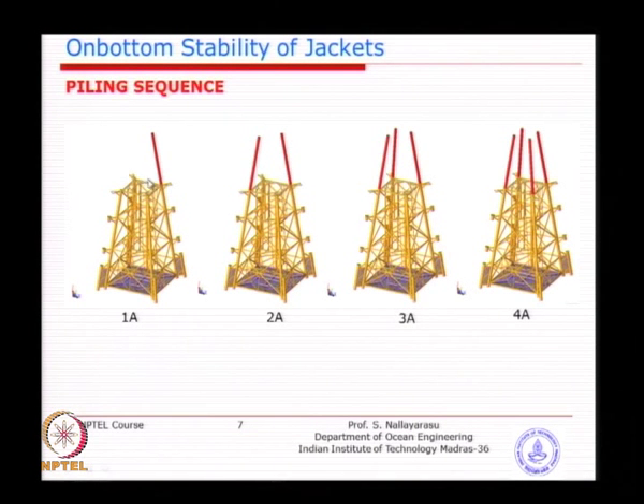When you place the pile on one location the COG shifts towards it. Once you place the second pile on the opposite side, the COG shifts back toward the original condition. Similarly, placing the third pile shifts it, then adding the fourth brings the COG back. All these cases need to be investigated. At the end you place the hammer at any of the 4 locations, and all 4 hammer positions should also be investigated.